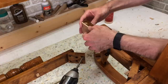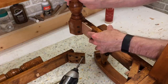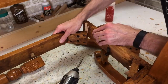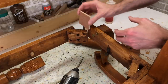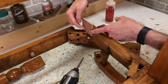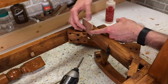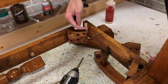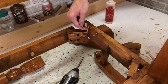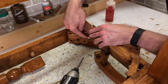On the chair I'm going to use one of these blocks. By adding this block in here, I'm going to use all this surface area to create a nice strong bond and prevent that leg from wanting to come off and splitting the wood. What it means is I have to modify this part a little because I can't put it back in that slot — I'm going to miter this off here. You might be concerned that I'm losing strength, but I've actually got over an inch of surface here once I miter that, and an inch of glue surface across that. Being on an angle is going to be very strong. The original joint here had just under a half inch, and the end grain is not strong — just over half an inch — about an inch of surface with a compromised end-grain joint. This will give me a much stronger joint glued from this component onto the plywood.